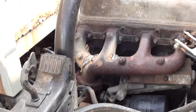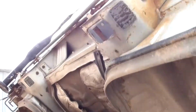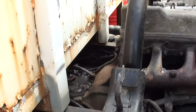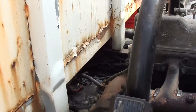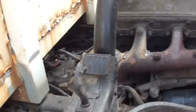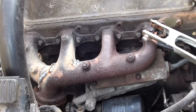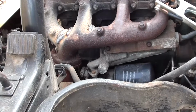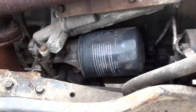But hopefully that'll take a bit of heat out of the engine bay while you're trying to drive the old girl. There is a bit of an open space at the back there. I kind of get a bubble effect going on underneath them, an aerodynamic bubble. It's either got to get down past the gearbox, and you don't want to heat the gearbox up as much either, or up out between the cab guards. So hopefully that hot air blowing around in there causing turbulence that's not designed to be there might stop it running any hotter. It looks to me like that down there is a heat exchanger for the oil,